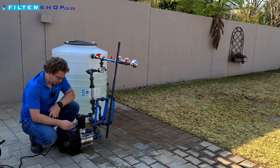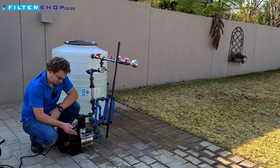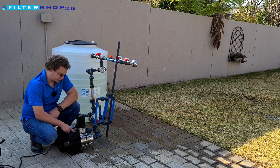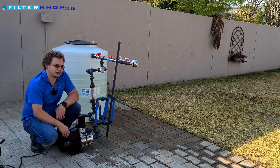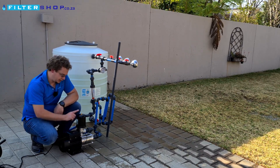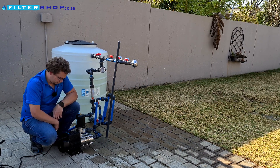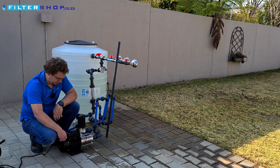Overall, very impressive and very good power consumption. It does better than the Easybox Mini at higher pressures, which is impressive for a pump that's significantly lower cost. The one thing we noticed is that to get this pump to work properly out of the box, you have to set its target pressure drop to above 90%, which means it's effectively not using the pressure tank. The 1.5 kilowatt version works amazingly well with the pressure tank, but on this one, if you use the settings to really exploit the pressure tank, it starts to behave more like a dump pump. Overall, though, it's actually a very nice pump — it's stainless steel, so no need to worry about corrosion, it can be used on most waters, and it's very power efficient.